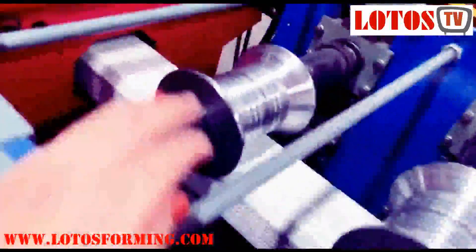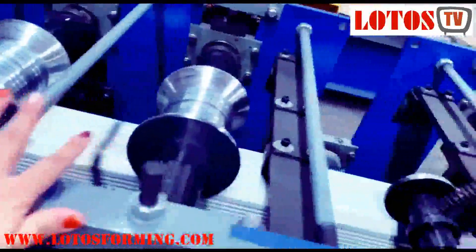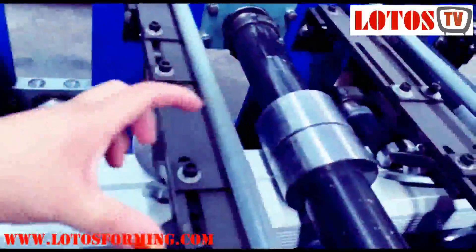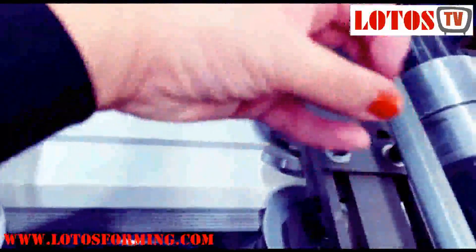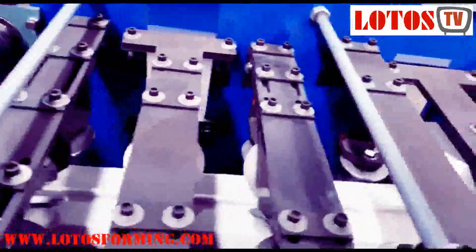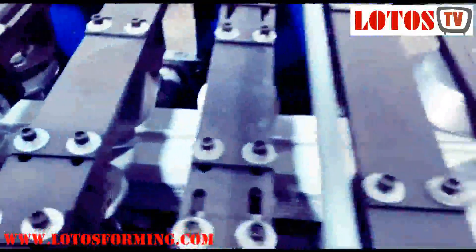From the beginning here, stations 1, 2, 3, 4, 5. Almost in each rolling station we have the side regulator. We call it a vertical roller to get it into shape. You can see in this area it's all vertical and horizontal — the down part is horizontal forming roller and the upper layer is vertical, especially to make the reinforce line into the pipe.